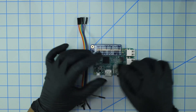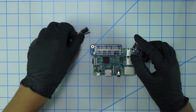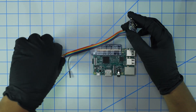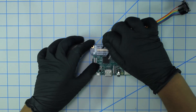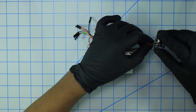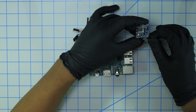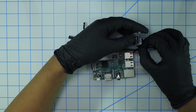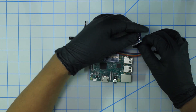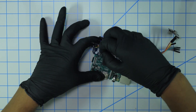The first thing you're going to need to do is find pin VIN on the sensor and plug in one of the jumper cables there — that's going to go to the 3.3V pin on the Pi. The next pin you need is the ground pin. Skip the 3VO pin and plug in the ground pin. I'm using this yellow cable here — there we go — and that goes to any available ground on the Pi.